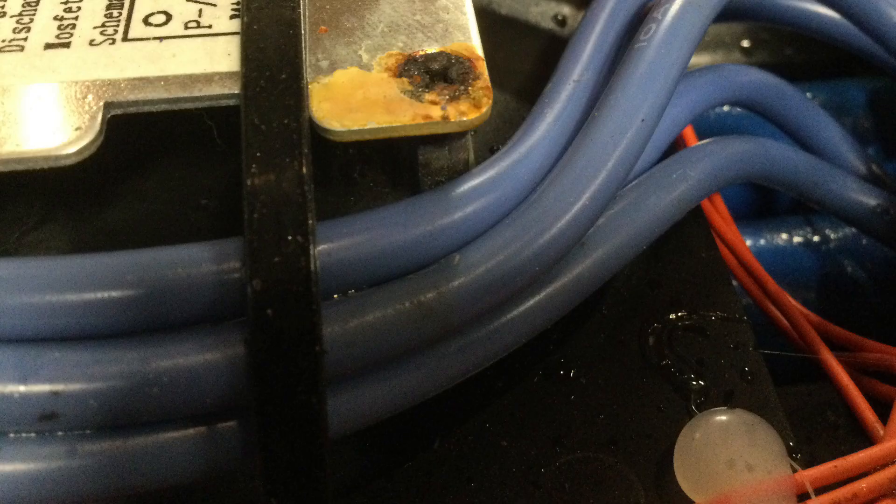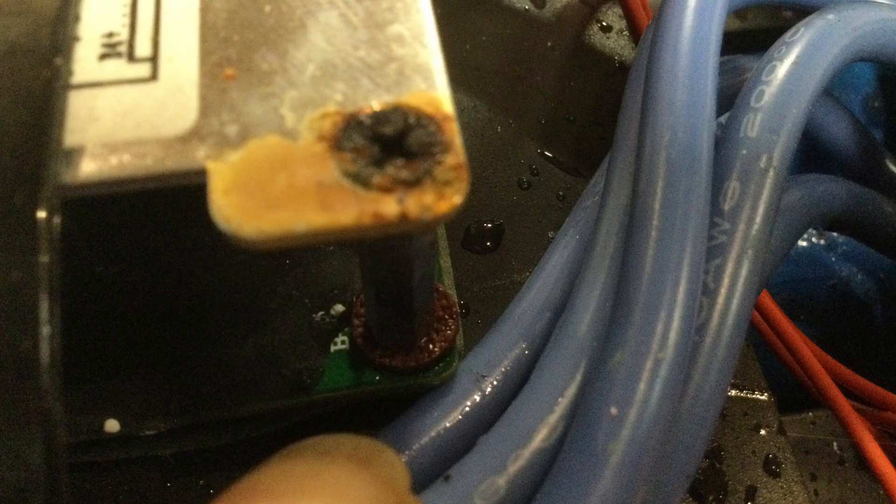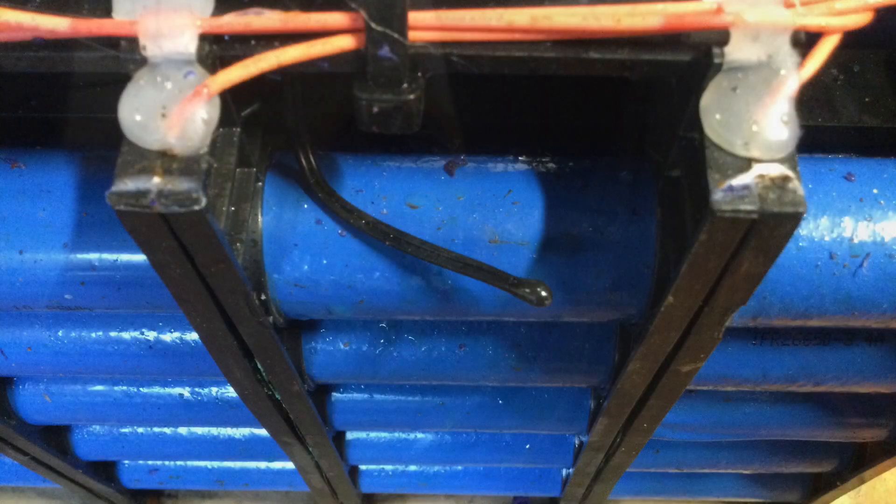Here's another issue I didn't really like: these wires were zip-tied and rubbing against a standoff on the BMS, which I didn't think was wise, especially if you're using these batteries in off-road vehicles or boats where there's a lot of vibration. Even more alarming, in one of the batteries, the temp sensor wasn't even taped down to the cells at all — it was just hanging out in the air, which is kind of scary.